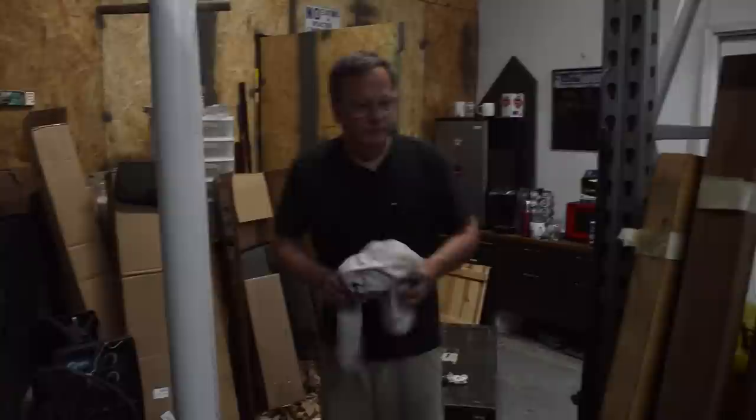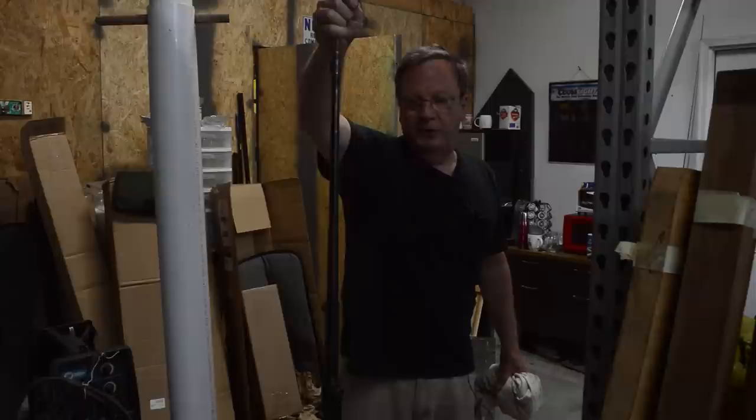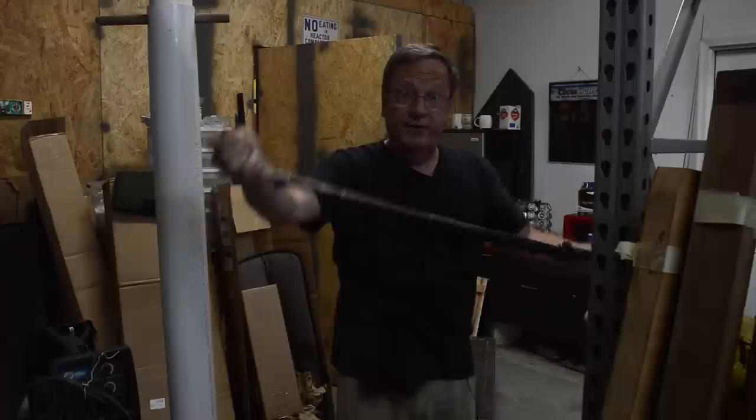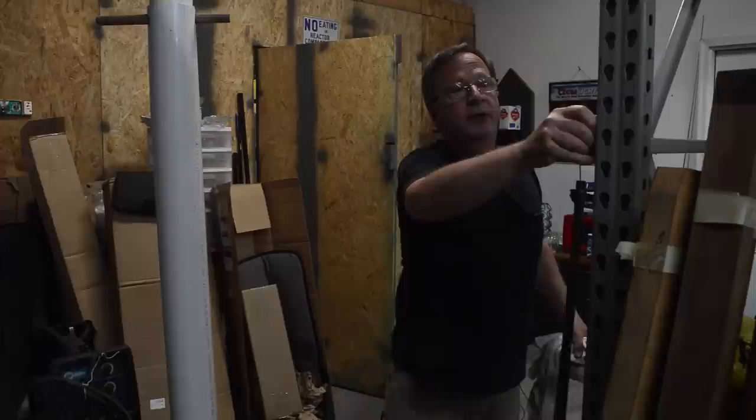All right, what I'm going to do here is just demonstrate how you use this steam pipe for these long pieces of steel that you're going to be bluing. So frequently as collectors, we pick up, we strip down, we get to a barreled action. Not many of us are able to have tanks and pipe burners and the gas to run them. We can, however, use easily available cheap items from the hardware store and build an inexpensive pipe steamer.